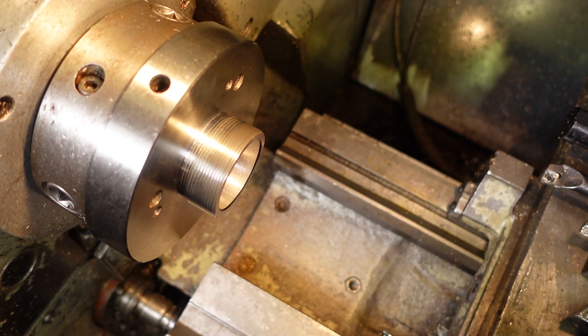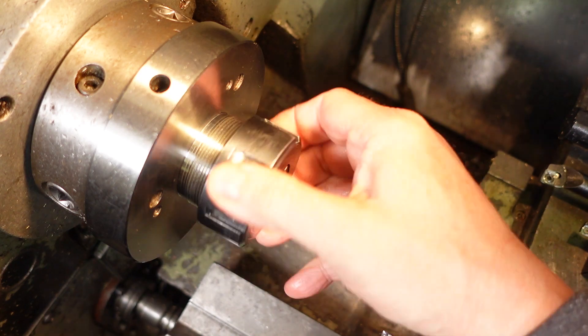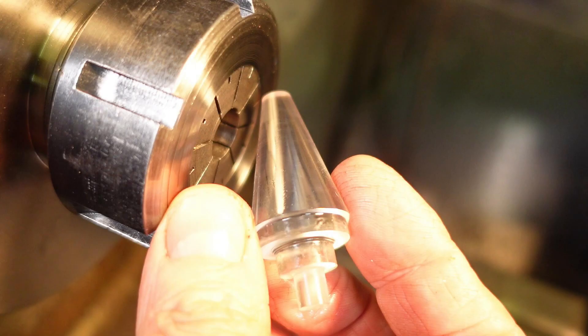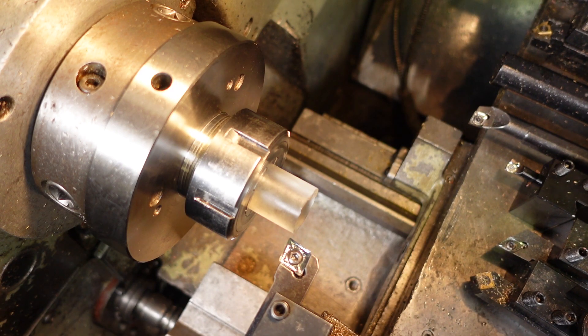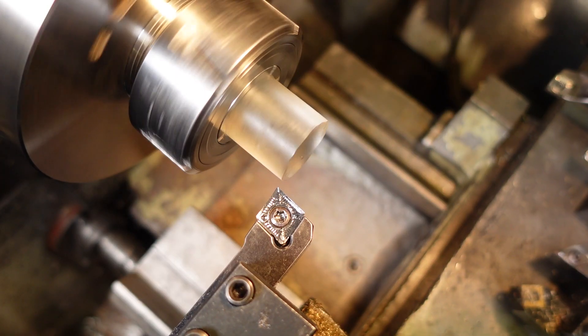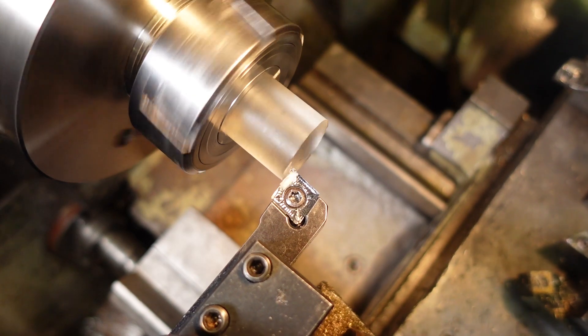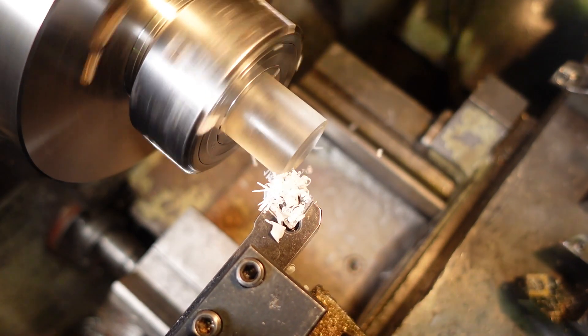This isn't a short but it's not long either. I've been running simulations of a new geometry for microwave dielectric lens antennas to fit round waveguide feeds at 10 gigahertz. The stepped section fits inside the waveguide tube and matches the impedance of the guide to the impedance of the filled bore. Then once outside the tube, the tapered section modifies the wavefronts and provides a match to the 377 ohm characteristic impedance of free space.